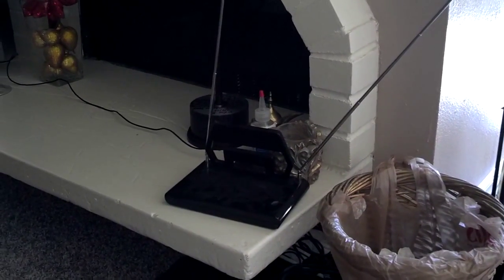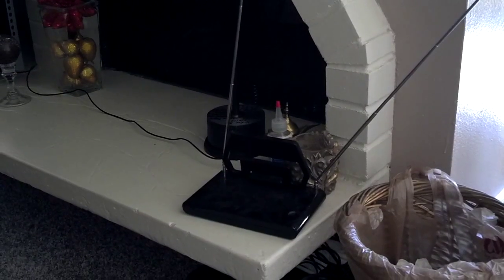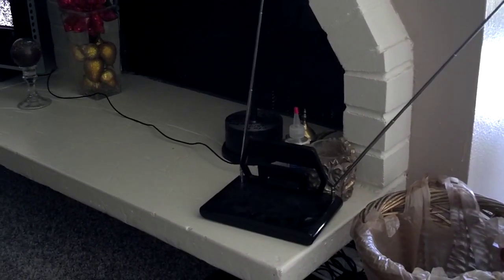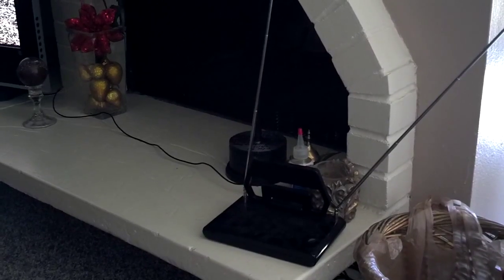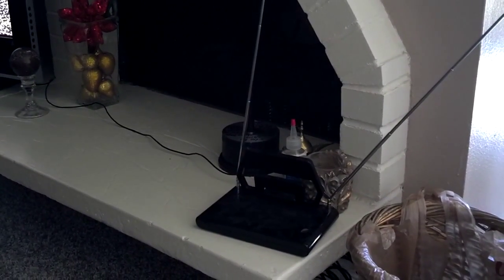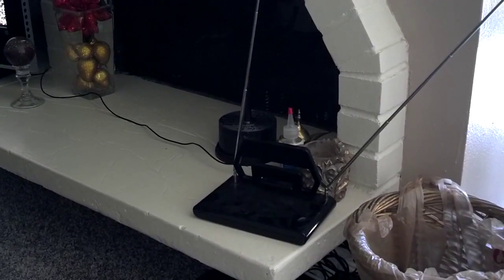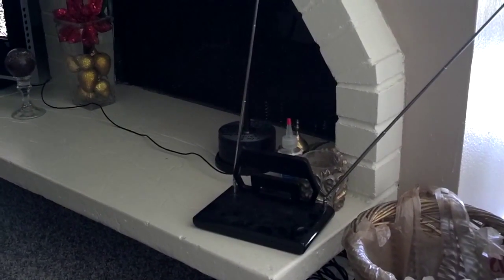Depending on your location — if you're on a hill, in a valley, or behind tall buildings in the line of sight of your broadcast stations — this can be done up to 20-30 miles from the tower, and sometimes as many as 50 to 70 miles from the tower if you don't have a lot of mountains in your way. Broadcast signals travel really far, but if you're on the wrong side of a building you may not pull in all the stations. You can get more than one antenna and hook them up. At one location I was behind a couple of tall buildings, so I hooked up an external antenna that I only paid five bucks for. If you need a stronger signal, you can get a powered antenna or one labeled HD, but your regular cheap five-to-ten dollar antennas should work fine, especially if you're in a good location.